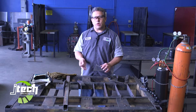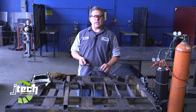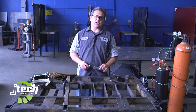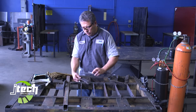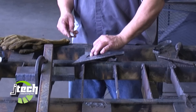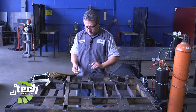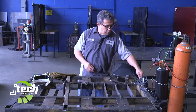If you're concerned with where the cut is going to be, you want to have a straight line drawn. Otherwise you're going to get a wavy, curvy line. Especially looking through the dark shades, it's very tough to tell exactly where you're cutting. A nice white line from soapstone helps you be able to tell that. So I'm just going to mark it across the surface there. Now we're good and ready to cut.